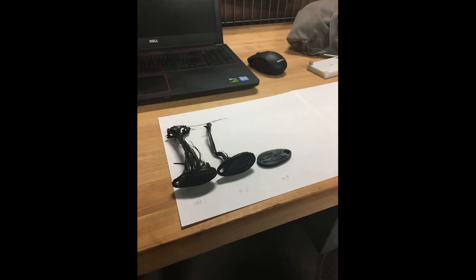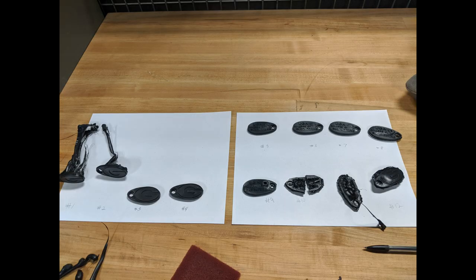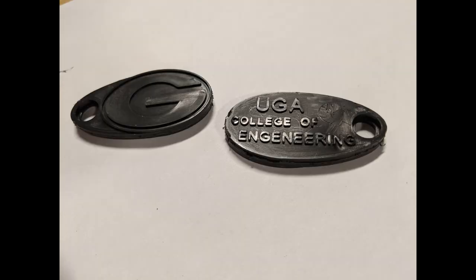Here you can see the result of our first three attempts. The first two didn't have enough time to cool, and they stretched apart when the mold separated. Once we allowed more time to cool, the part turned out great. The lettering and surface of the keychain was clean, though there was some flash along the parting plane from a lack of mold holding force. The large spot where the injection flash was removed is also very noticeable. After a number of good runs, our parts began to stick to the mold again, which we believe was due to overheating of the mold since we did not properly set up the mold temperature check device. With our process complete, we got a good number of quality keychains.